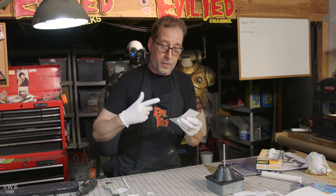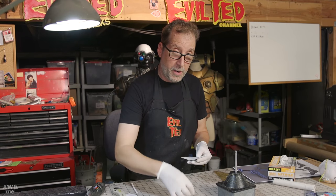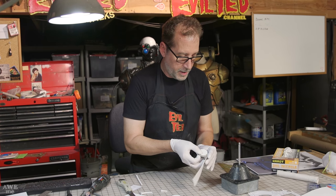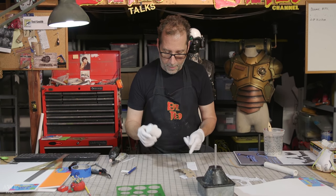The purpose of letting this stuff dry before you apply them together: it's contact adhesive, and as the name says — contact. The glue works in a contact form. Both surfaces are semi-dry. If you let them dry too long, sometimes they don't stick as well — just put it on and wait a couple of minutes. Once it dries, it makes contact with itself. A little finessing, and it's all glued and stuck together. Now we're going to work on our second wrap using one millimeter foam — made a template, traced it six times.